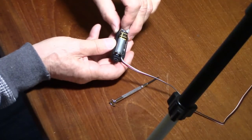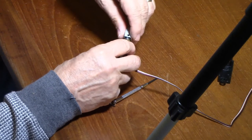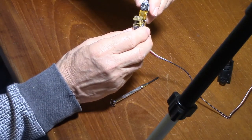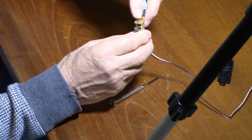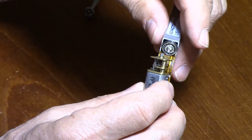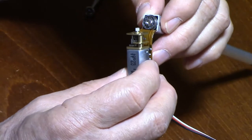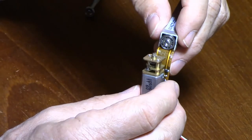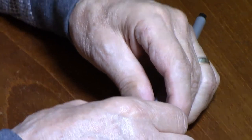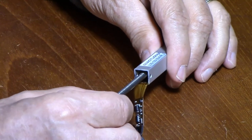So you've managed to get the bottom plastic case off now. Yeah. So that comes off like so. The drive from the motor to the lead screw is by this flat keyed shaft end. The gearbox is all mounted in a brass chassis. And that is a ball bearing, isn't it? Because I can see the balls from here. And then you've got 2 contacts going into the thing. Presumably there's a potentiometer inside. I guess those are the contacts to the potentiometer. Right, so now the lead screw will come out.